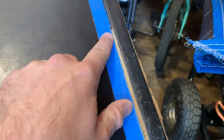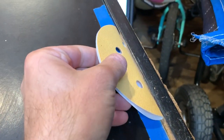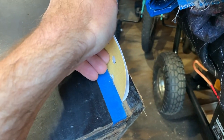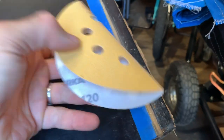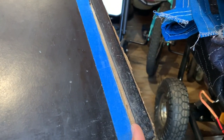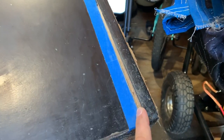I'm going to get new T-molding, so I'm not worried about sanding against this and using it as a guide. I cut out the old wood and then took a sanding disc, folded it, and carefully — without putting too much pressure on the tape, because I don't want to wear through it and ruin the vinyl — I came in vertically, then at a diagonal, and just kind of worked the corner. It's 120 grit, I think, and it actually came out pretty good. The front and inside are now flush with the T-molding — not a perfect right angle by any stretch, but a hell of a lot better than it was.